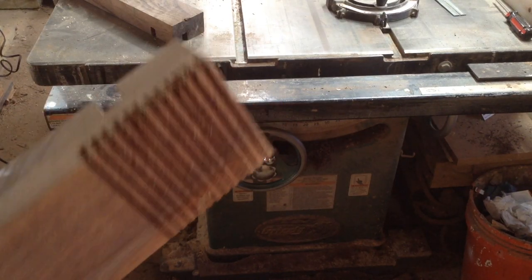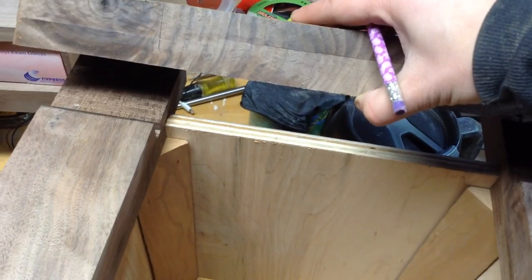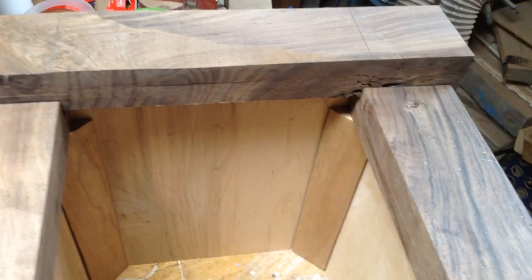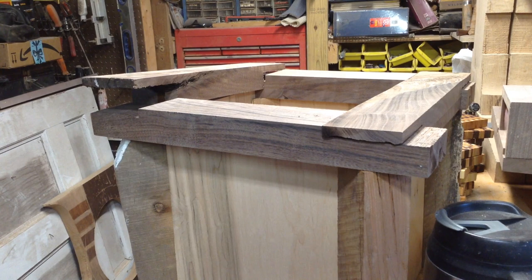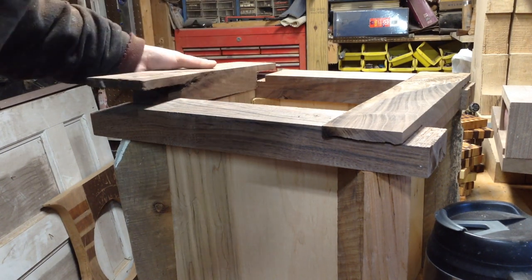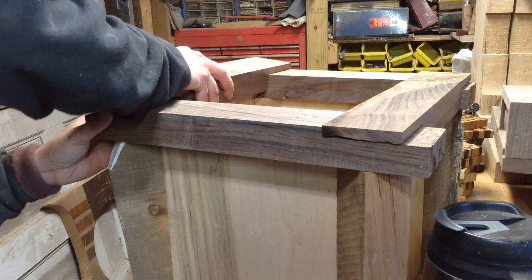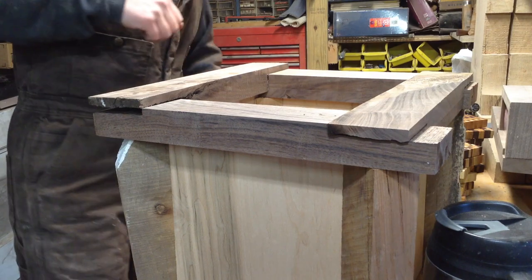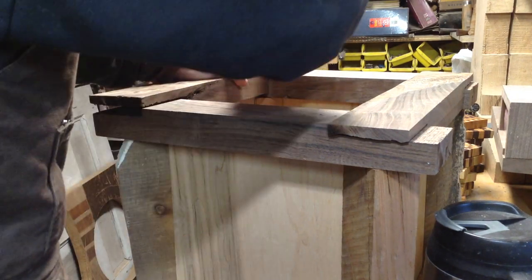Even drilling through the whole piece and adding dowels would be super sturdy. You can see I'm doing laps — I removed half the material on one piece and I'll remove half on the other side, and then with that dado groove on the bottom this whole thing slides into place and is now very sturdy.